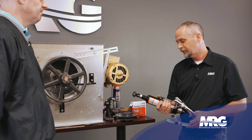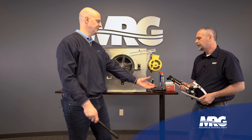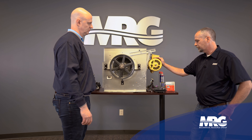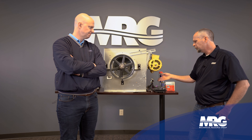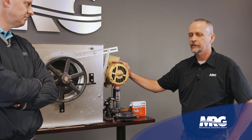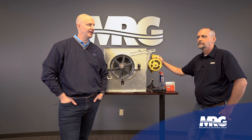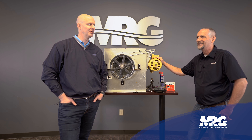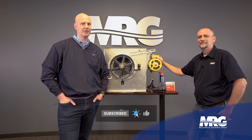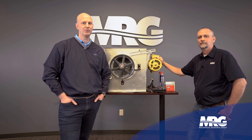We're going to make some other videos talking about changing other types of devices like bearings and tower hubs and all that good stuff. But we just want to start here — pretty basic. One you'll see quite a bit out there is this three-jaw puller, a really handy tool. Every technician running service should have that on their truck, in multiple different sizes — they come smaller and get much larger. So there you have it — that's how to pull a pulley or a sheave without breaking it, hopefully. Thanks for checking us out. Hit that like, hit that subscribe — we love to hear back from you. Hit those comments, and if you have something specific you'd like us to cover, we would love to make it for you.